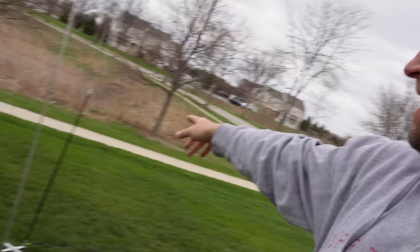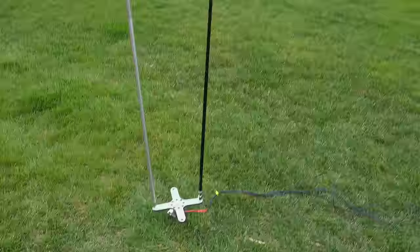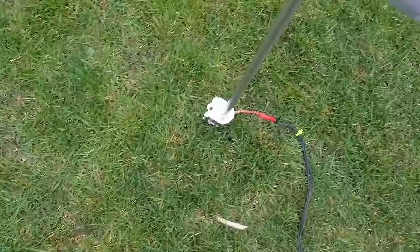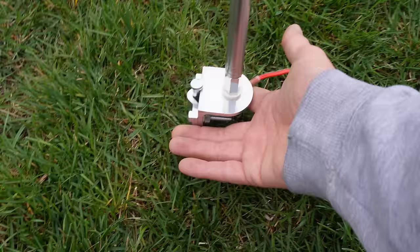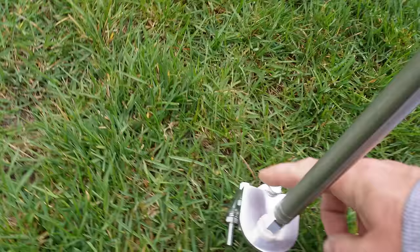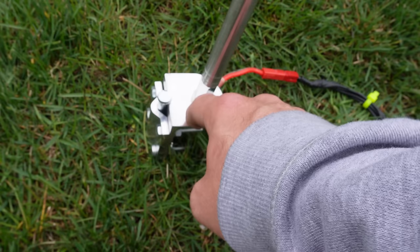Until the fabricated base plate comes in for the Hamstick Commander, this setup would be a bit weak, but I have a quarter-wave 20m and a Hamstick 40m, so I should get both bands. You can see there's some separation and bending because the plate isn't strong enough — I've got that taken care of, thanks to suggestions from the last video. This will break eventually, so I won't push it, but I thought it was cool to mention. When you're done, don't grab the ground spike by the antenna or you could damage the threads. Just pull right here and it pulls right out. You could even put a carabiner on here — let's drill a hole for one right now.